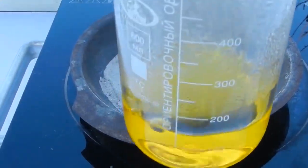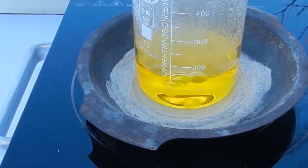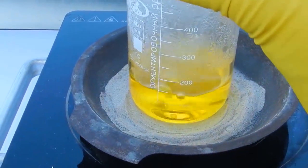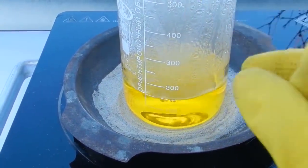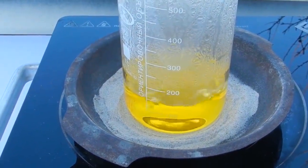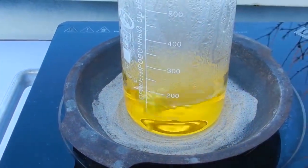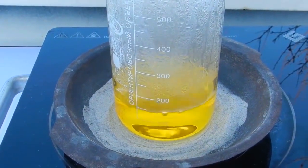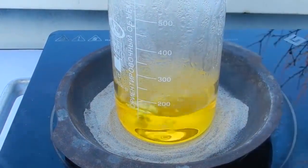The solutions were poured into such a large glass, and pay attention to how large the volume is. This is due to the fact that when I began to dilute with water, precipitation climbed, due to the fact that we still somehow get tin. And therefore, the gold from the solder solvent in that glass needs to be processed somehow differently. But in the end, I filtered everything. We won't even quench it, because the solution is very diluted. When highly diluted with water, absolutely nothing needs to be quenched. Well, if the solution is concentrated, you need to add urea.